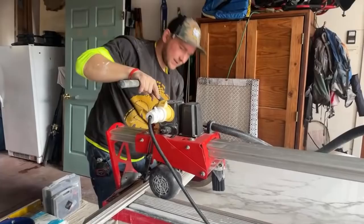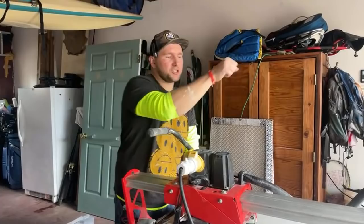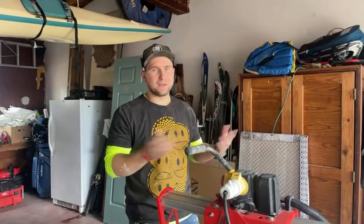So when I'm cutting it, you'll see that I plunge the front end, plunge this, and then make my cut. Because if you just start from there and cut all the way across, you have this massive piece of tile that's vibrating, right? When you get to the tip over here, it will chip. It doesn't matter which type of saw, it'll blow out. So you have to pre-cut the ends and then cut the middle, and that'll never blow out. So check this out.